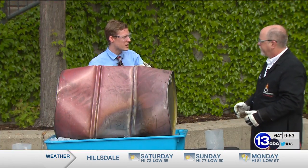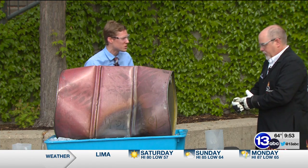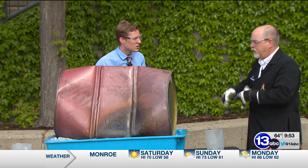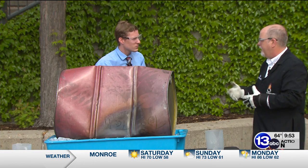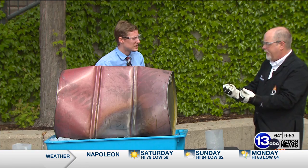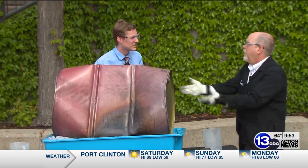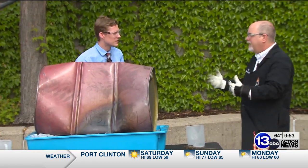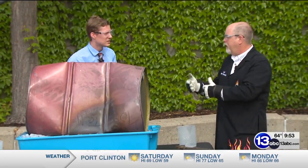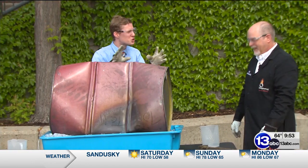I've seen this on oil tankers, on train cars — it's a bit of that demonstration, obviously on a more massive scale, but it's exactly the same thing. There are some cases where they were steam-cleaning out the container, sealed it by mistake, and when that steam condensed back down to liquid it takes up less space — 14.7 pounds per square inch on the outside and maybe 12 pounds on the inside. It doesn't take much: as long as there's an imbalance in pressure you can get it to fail. At least this was by design — sort of.